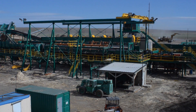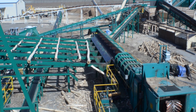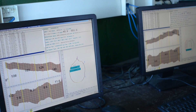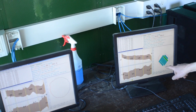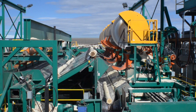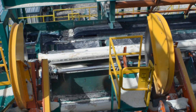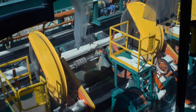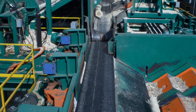The first place we come into is the merchandising area. Stems themselves will go through a debarking process and then we hit the first set of scanners. We're looking at overall diameter and the profile of that stem, trying to identify the characteristics and coming up with the solution to optimize it for the best recovery. That information is fed right back into our PLC system. We have a six-saw merchandising line. One of the upgrades we did last year was to add the veneer plant to the process here.